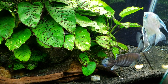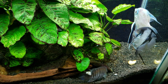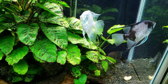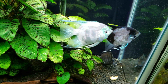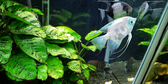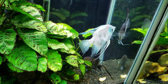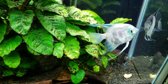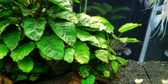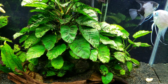I'm not exactly sure how to categorize that tip, because most people won't encounter it — especially if you've got municipal or city water, you won't need to do maintenance on your own filters. But the other day in the shower the water was flowing as though someone was running it elsewhere, just a really diminished water pressure. I changed that filter and now my showers are full and vigorous again. It never crossed my mind that the more vigorous water flow would apply to all my faucets, and as a result I filled this tank probably 30 to 40 percent faster than I normally would have.